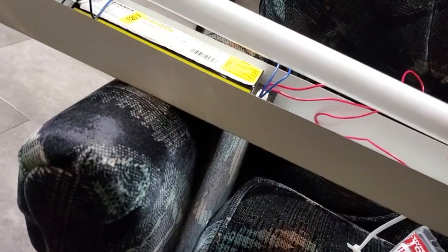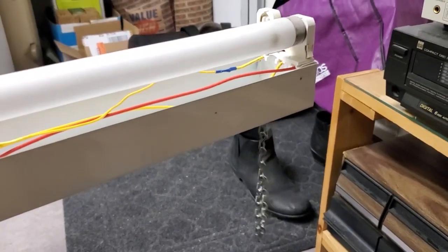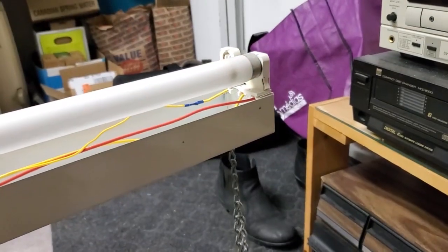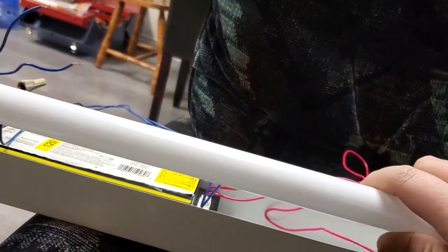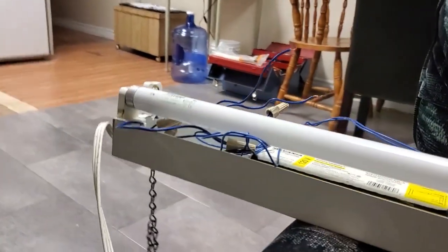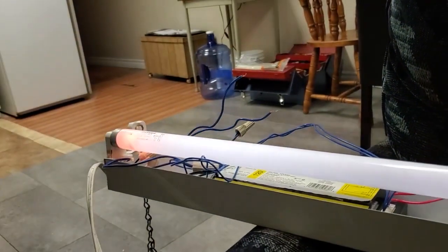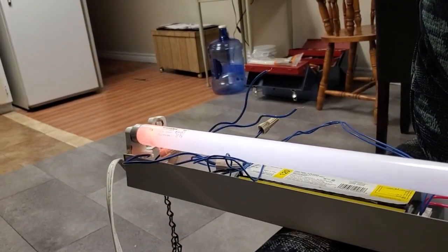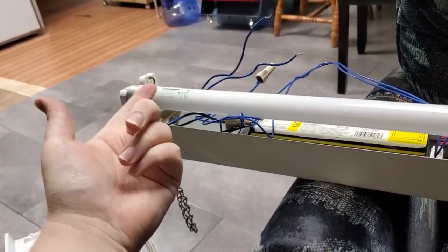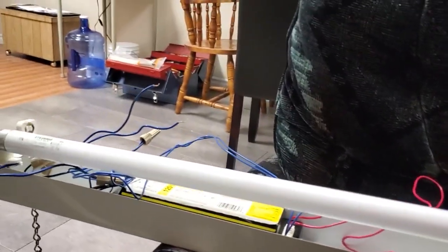Now I'm really curious, so I'm going to do something a little naughty. I'm going to unplug one end of the lamp - I want to see if the cathode glows indefinitely. Wow, that's a very bright cathode glow. Does it do the same for the other side? That was not good for the lamp - it pushed a ton of current through that cathode. That's really bad for the lamp. It briefly pushes a little extra current through the cathode - enough that it actually strikes an arc across it, which isn't really that good for it. Sorry lamp, that was not good.